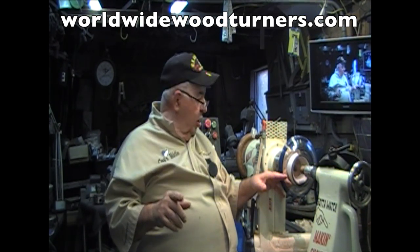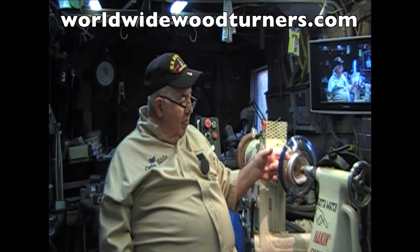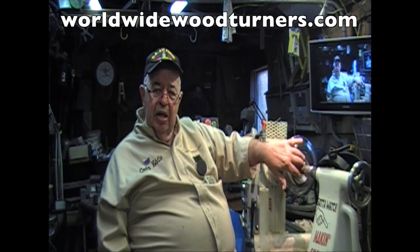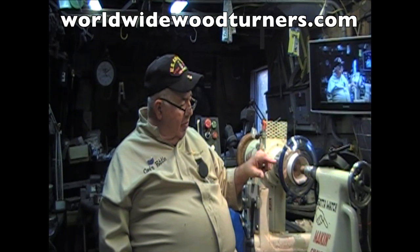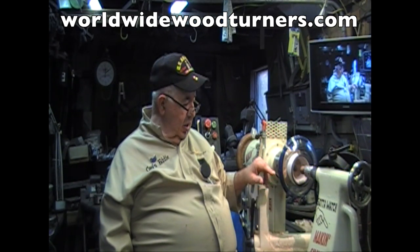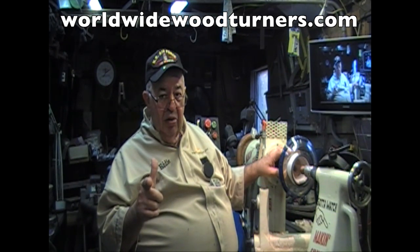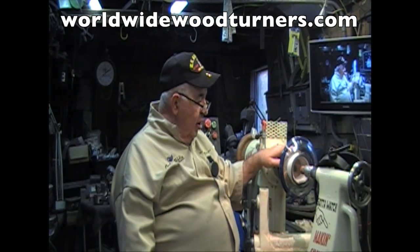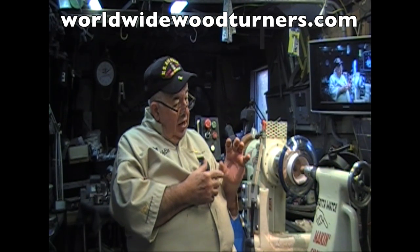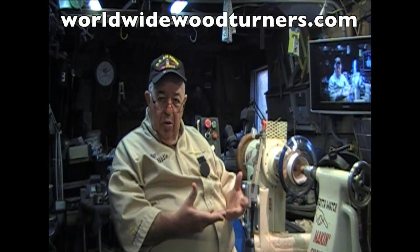Now, my vacuum chuck was working, my Pittsburgh made in China vacuum chuck. I put my rod in, put the gasket on, bring this up, get it balanced out, and then when I pulled it away, I could clean up that center. Pardon me, I got the hiccups. I don't need any more than light pressure. That's what I'm going to generate, some light pressure to do it. That's if I use the vacuum chuck. But just between us, if you don't have it, you don't need it. You can work around it. If you make a little soft touch to go on your tailstock, and a soft touch on this side too, to push the bowl up against, then you can turn the bottom, and it'll be beautiful all the way around.